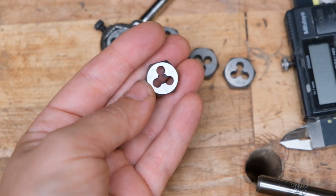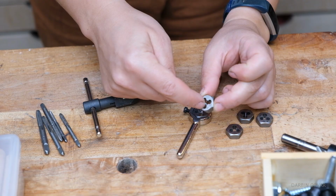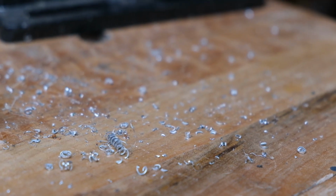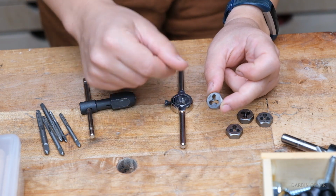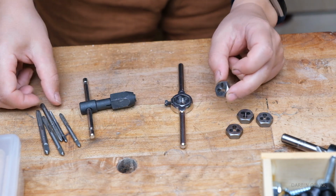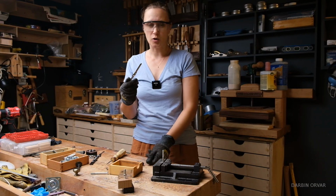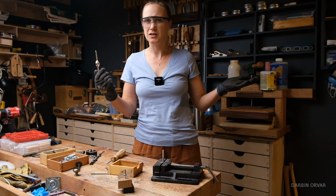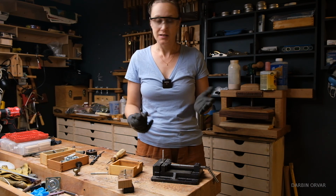And the reason why this is shaped the way it is, the metal shavings get bunched in here so they can fall out. And then you have these threads on the inside here, which is what is doing the cutting. And on this side you have the reverse. This is a 1/4-20. And these kits are pretty affordable, like, I don't know, $15, something like that. I'll put a link in the description. And basically, it's quite simple.